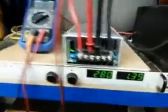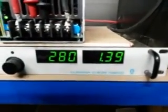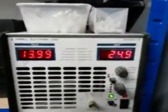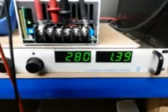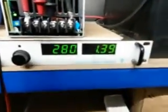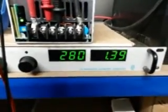At the moment I'm feeding it 280 volts DC and it's consuming 1.39 amps. We're getting 25 amps output for 1.39 amps input current — that's not a bad conversion. Obviously the higher the input voltage, the more efficient it is, or the less current is required to do the conversion.